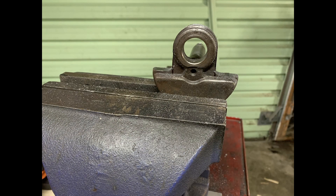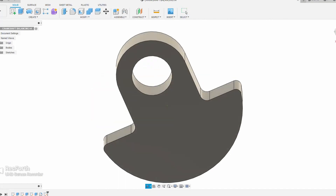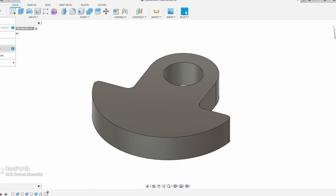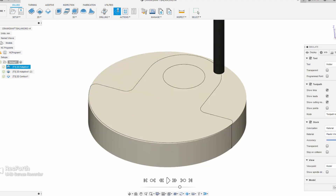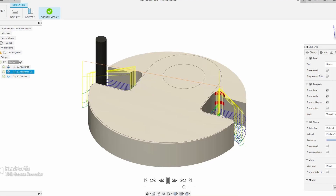This is what we ended up with. In my honest opinion it looks pretty rough, and truing it up with a file and an angle grinder reeked of effort. Because I have a few tools and I'm inherently lazy, I decided it was time to utilize the mill. I went inside with some calipers and the crank wheel, measured up the rough dimensions, removed the material I wanted, and ended up with this. From here I went into the CAM side of Fusion and programmed removing the rest of the material and contouring it so the whole thing was symmetrical.